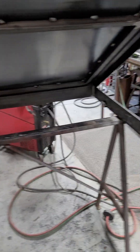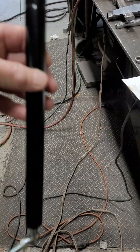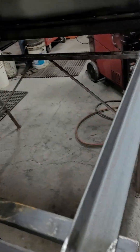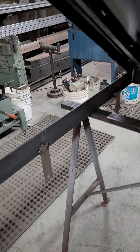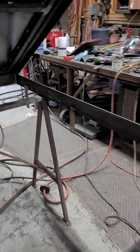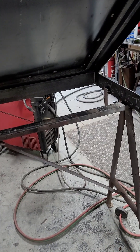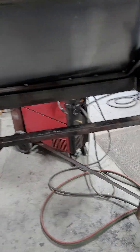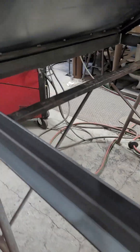That's really old concrete — I tried to get down far enough so it'll hopefully bite into some good concrete. What I'm working on today are some struts. These struts are going to go on the lid, so there's a bit of a learning curve on where to put them and how to place them. I'm going to make a mount for those to go right on that three-inch, and my plan is to attach it up here. This is basically meant to open from the inside, so I'll need a couple of locking mechanisms so it can't just be lifted up from outside. When the homeowner is in the basement and wants to come out, they'll just pull a lock pin and push this up.